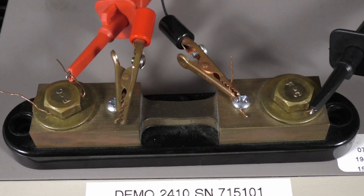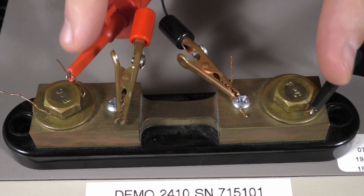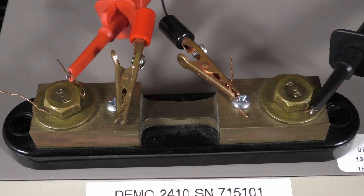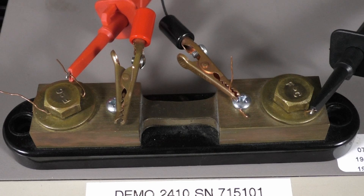Now we're going to make our connections to the DUT. This is a typical four-wire measurement, so you're going to want your source lines on the outside. In this case, these are the lines coming out from the 2400 SMU, which is going to source current, and the sense lines on the inside — the 2182A, which is going to be measuring voltage. Once you have that set up, make sure you attach a trigger link cable between the 2400 series SMU and the 2182A. From there, we can set up the measurement.